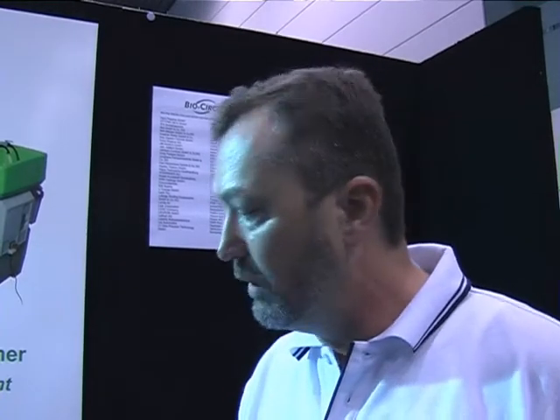We have here a system that doesn't use solvents at all. It uses a water-based system that uses naturally occurring microbes that literally eat the oil and grease. They break it down into CO2 and water. So the actual solution itself is self-generating. You do not have an issue of having to dispose of used toxic waste, which is a major concern and major cost with solvent washers.